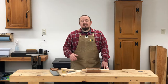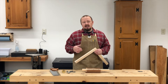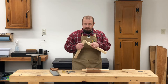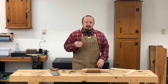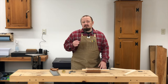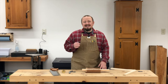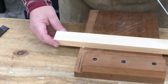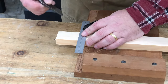With the first class saw cut, we're looking for the most precision that we can get. These are typically going to be joinery cuts, something like the shoulder cuts or maybe even the cheek cuts of a mortise and tenon joint. In these cases we're going to use the knife just like we did in the second class saw cut, but we're going to score even deeper and make a relief for the saw to drop into. I'm going to lay out this first class saw cut very similarly to how I laid out the second class saw cut — I have my reference marks and I'm going to reference my square off of those.